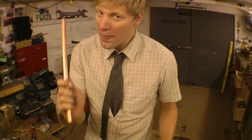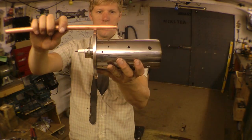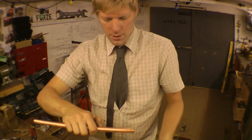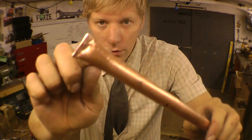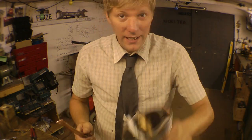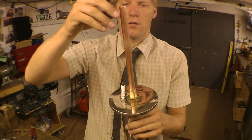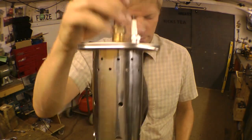Now we need to do our fuel rail, which is going to be a bit of copper tube — this may melt when it's working, but if it works I'm happy. Get the copper pipe, it wants to go in without that much. Your gas wants to be coming out here so it can fuel it. We're going to have to crush the end of the pipe, then drill a few holes — four 2.5mm holes around there like that. Tighten her up. Flame tube, fuel rail, spark plug — all done.